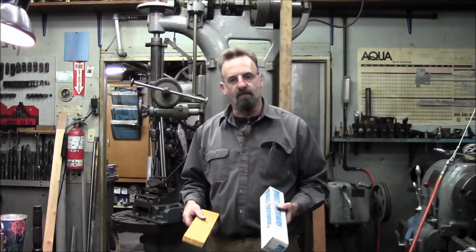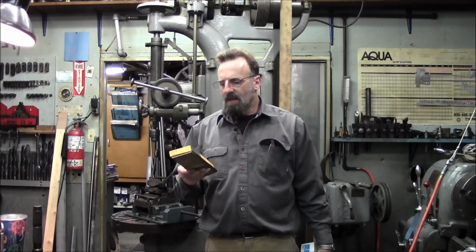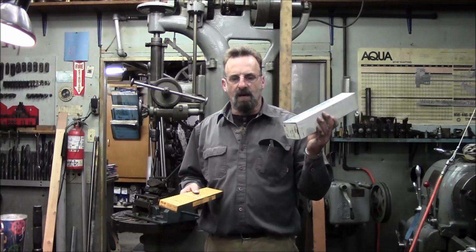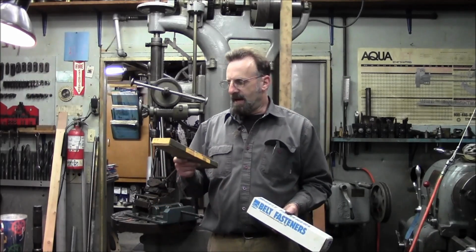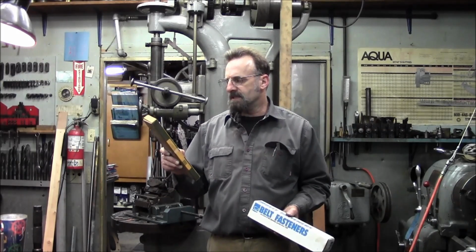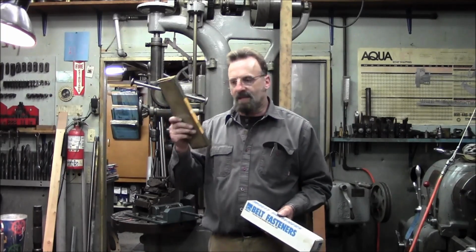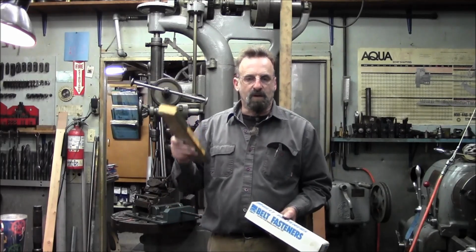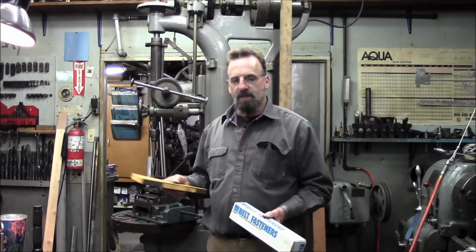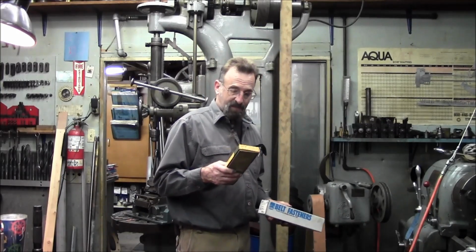And by the way, Donald, whether you're going leather or the transmission belting, they nail you pretty big for full packages of lacing, and I have more than enough. Ideally, if you stay between 3/16 and 7/32 on the transmission belting, I've got what exactly works for that size there. And you just saw me put it together, and you can hammer it or you can squeeze it in your vise and hammer it. It's really the way to go.